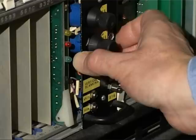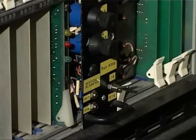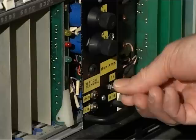Down in this bottom corner of the chassis is a BBC modification to this machine — the vertical run amplitude controls, part of the zoom control board. We have two controls: one for all formats except Super 16, and the switch switches to the second control for Super 16. This is done simply because the gate optics are different between normal formats and Super 16, as different lenses in the gate require different settings.